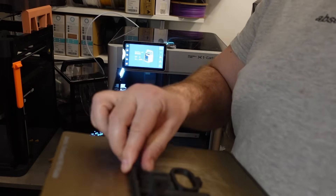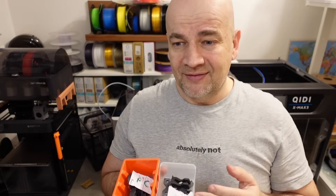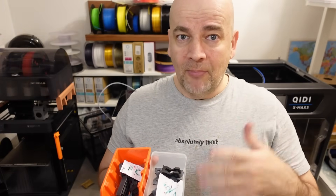Printing is at 66% and looks okay so far, it will be finished in 22 minutes. This is the test object for the warping test — I have one from regular Nylon and this will be the carbon fiber version, and you will see this test soon on my channel. All test objects are printed, but before I start mechanical testing I will wait at least one week, because Nylon absorbs moisture from the air — not only the filament but the printed objects too. After one week it will be very close to the stable state.